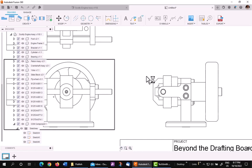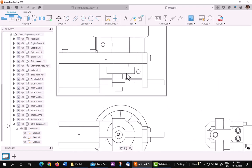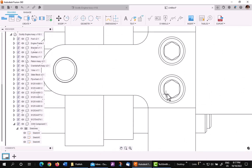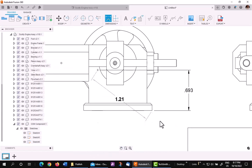What you'll see is a little X. There's the center of gravity point in the top view, front view, and the right side — a little hard to see, but there it is. And you can dimension these just like before. I'll just do this one from the bottom — from there to the bottom — and from here to the front. So you can do it in any view you want. This will take the place of my other method. I'll update my blog when I get a chance. Thank you so much.